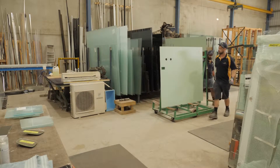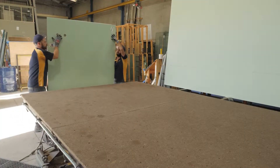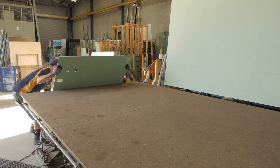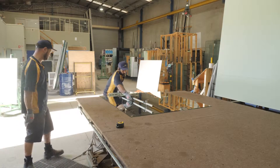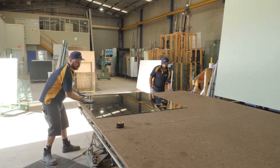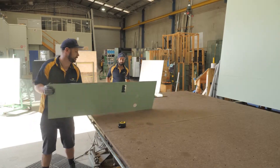We'll cut it down and just chuck it in the bin because that one's rubbish. Now we just need to watch this as we lay it down because we've got these cut outs in the glass — it makes it very weak. So rest it against the table. Slider out. Beautiful. Nice even pressure. I'll run it out. That one's beautiful.